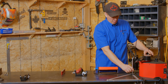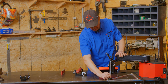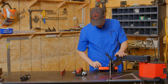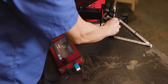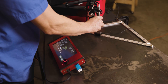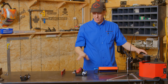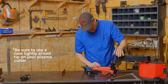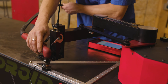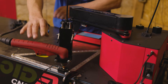Next, same thing in the other corner. Now the screen will show values that it's capturing. They will all be in the 20mm range — this will vary depending on your torch and machine. Switch to the torch and do it all again. It's important that you move smoothly and slowly in order to get the values to capture correctly. If you go too quickly, you may skip a hole.